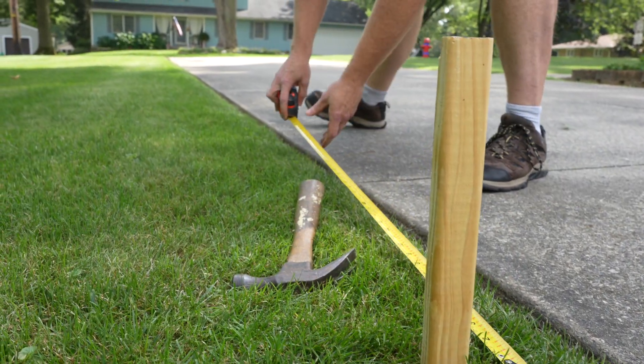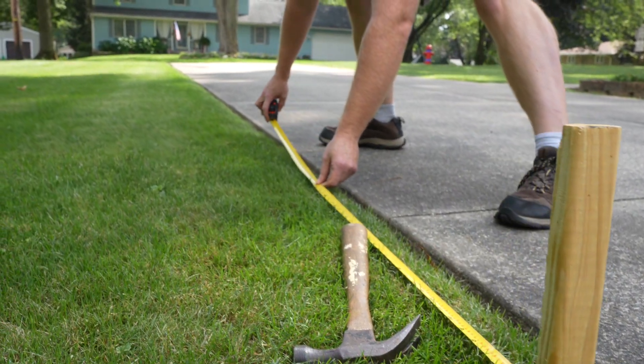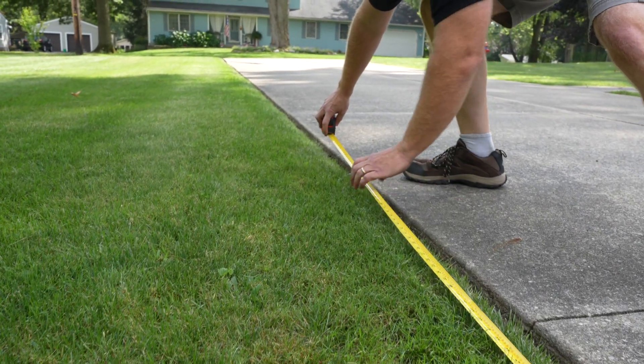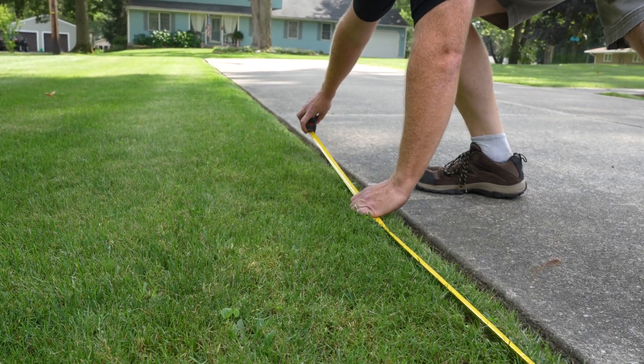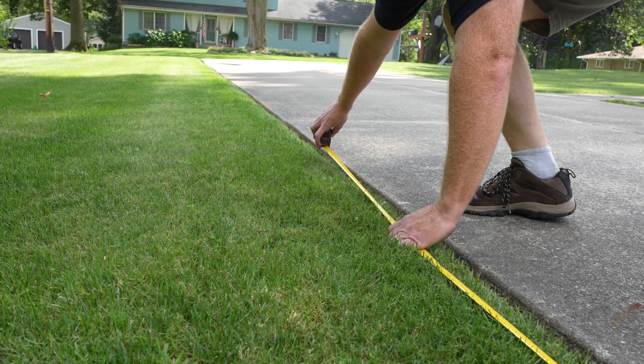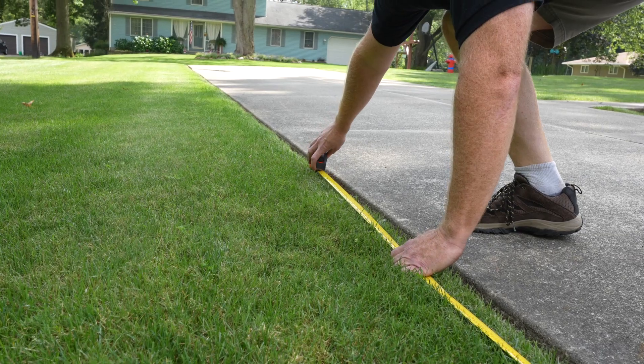If you need to do this to get your total fence run measurement, just be sure to add up all your sections to one number on the drawing. So if you had to pull the tape out 25 feet two times and then 11 feet to finish for one run or leg, add that up to 61 feet for that line on your layout. If you display it as 25 feet, 25 feet, 11 feet, we may think that you have a step or grade change that really isn't there.